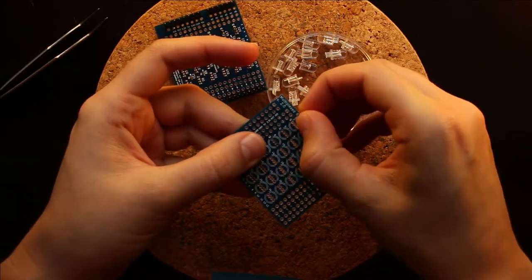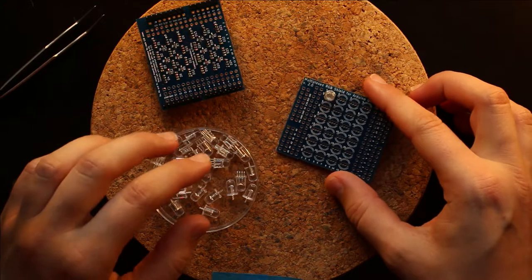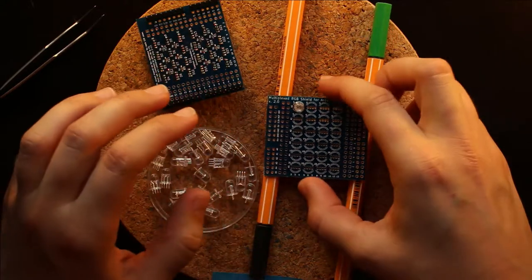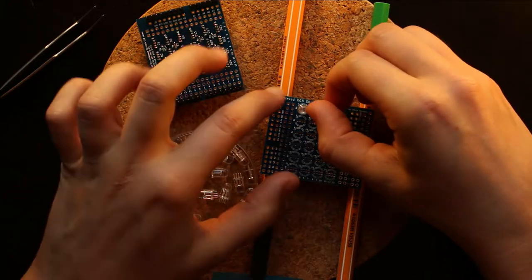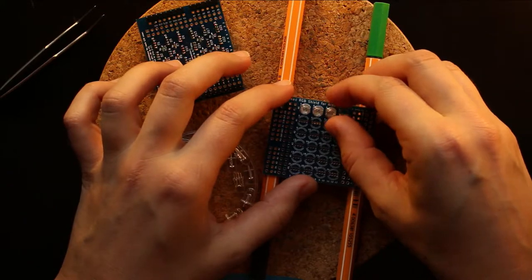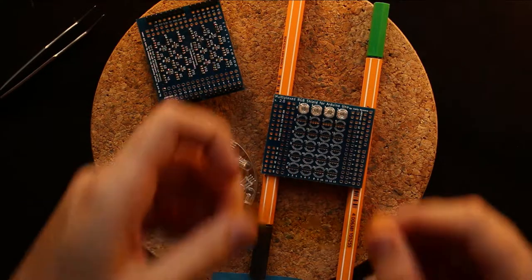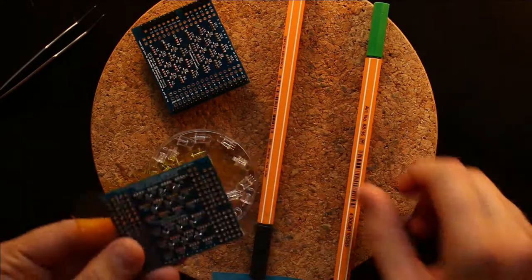So we can go ahead and place the LEDs in the board. And in this case, it's easiest if you take two pens or pencils and just set them down like this. And then place these in the right place. And then take a piece of tape and tape over the LEDs. Then you can flip it over